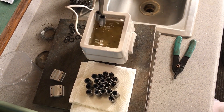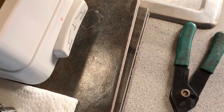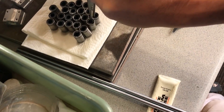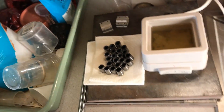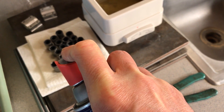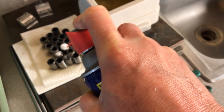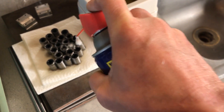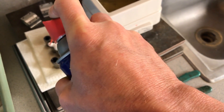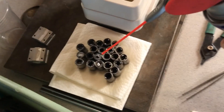There's a video I saw where somebody took them apart and showed that. Listen to the jiggle — that noise is the little steel balls in there rolling around. Now I'm going to give these a little coat and rinse with WD-40. The reason I'm doing this is because the alcohol I used is 91%, which means some of it is water. WD-40 stands for Water Displacement Formula 40 — I want to displace the water and place a little bit of lubricant on these freshly degreased bearings.